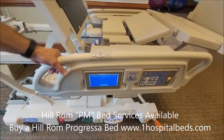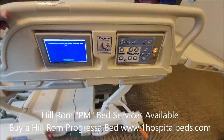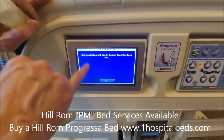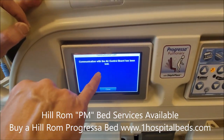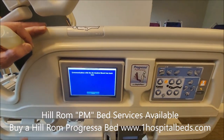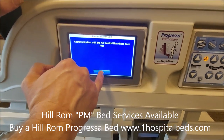I know that you go into the main control board and basically recalibrate the mattresses. Yes. And as you can see here, this one is telling you that there's a communication issue with the air control board, because the mattress is off. The air control board is in the mattress on this one. But we would go in here